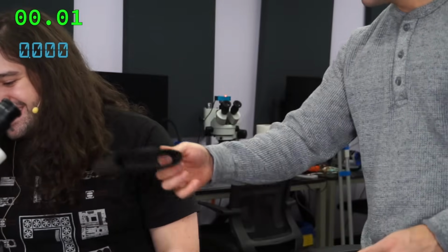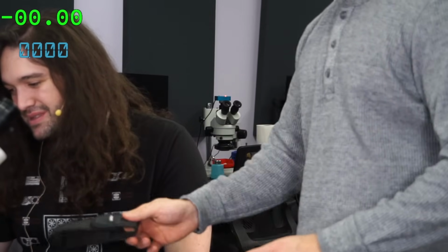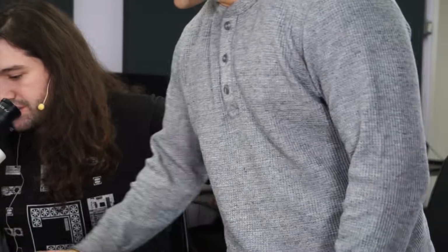So first thing we have to do is come up with an order of operations. Okay. So you have some corrosion on here. You have corrosion by the screen, Wi-Fi card, and a power rail. Right. Which one is the one that you would address first? I feel like the power rail is... Yeah, it's Maslow's hierarchy of needs. So first you need to turn on, then you need a screen, then you need internet. Right, right. So power rail.